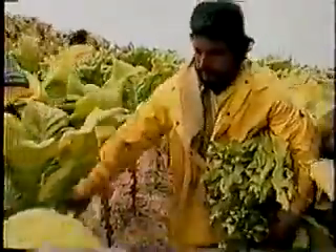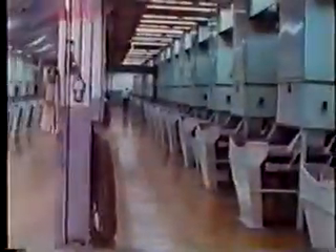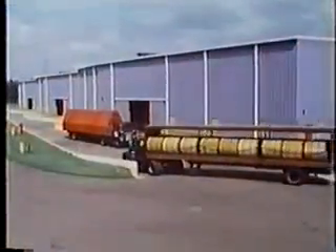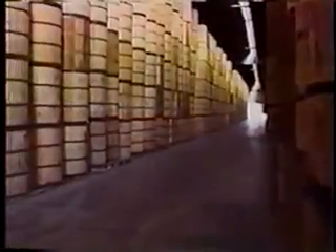The process of making cigarettes begins in the field where the tobacco is grown and harvested. There are two types of domestic tobacco: bright and burley. The unique taste of American cigarettes is a result of blending burley and bright tobaccos, which have different characteristics. Once the tobacco is harvested and dried — a process known as curing — it is shipped to a stemmery, where stems and veins are separated from the lamina, the preferred part of the tobacco leaf. The lamina is sent to a warehouse, where it is aged for as long as two years to mellow and develop its flavor.